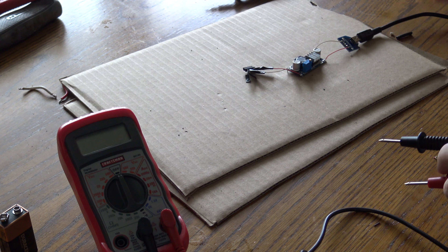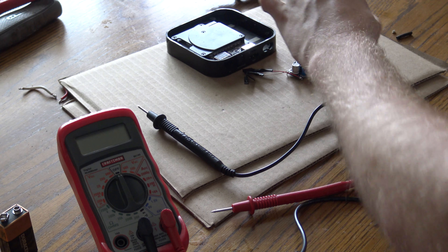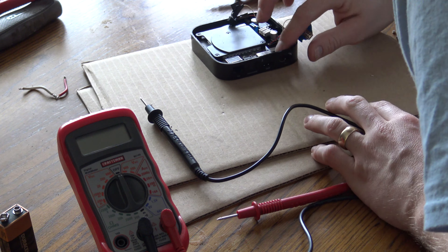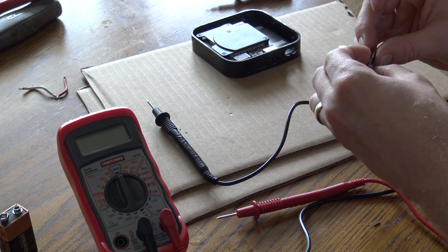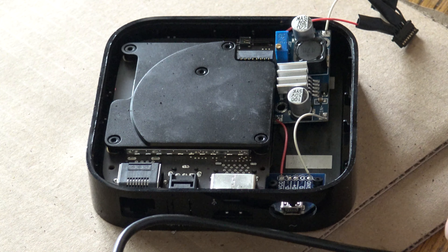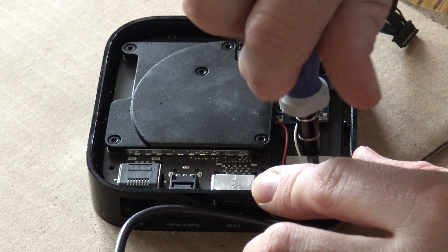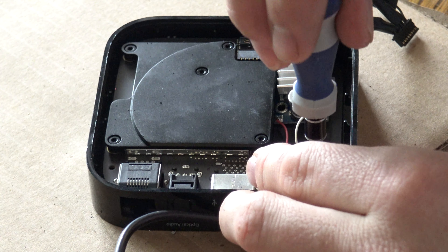I'm going to put the step-down module into the Apple TV case now and re-plug everything in to re-verify voltage before connecting to the Apple TV. I got the spacer in there and one screw in already — the screws seem long enough. The bit you need is a T6 bit for these screws. I put both fasteners in — not cranking them down too hard — and now I have the USB port mounted right there.